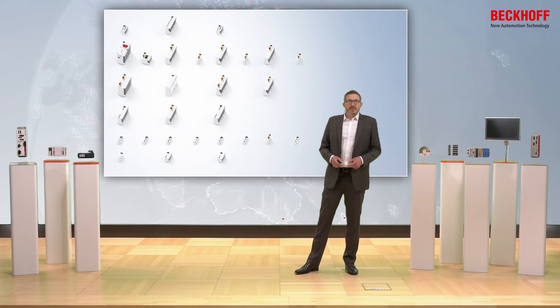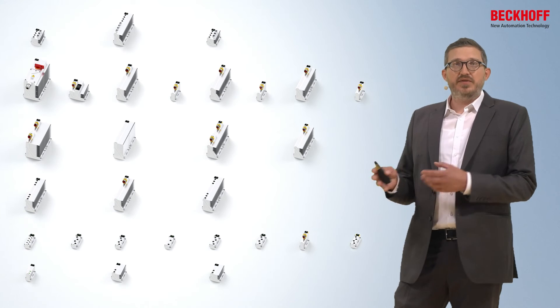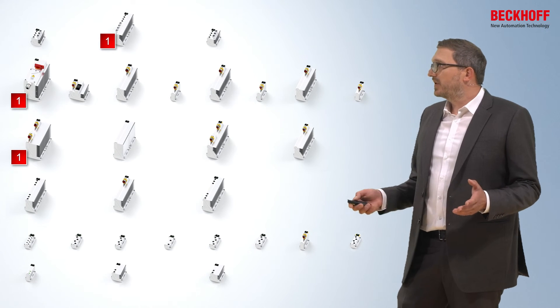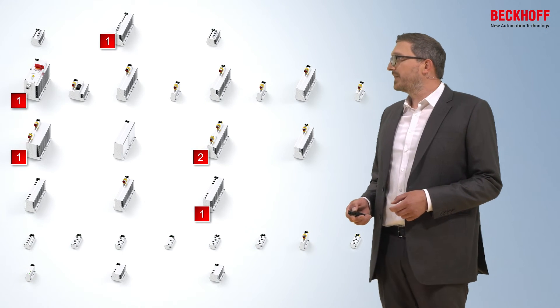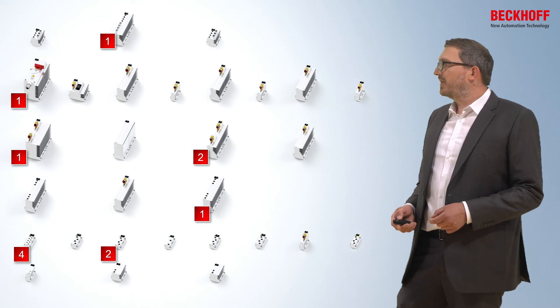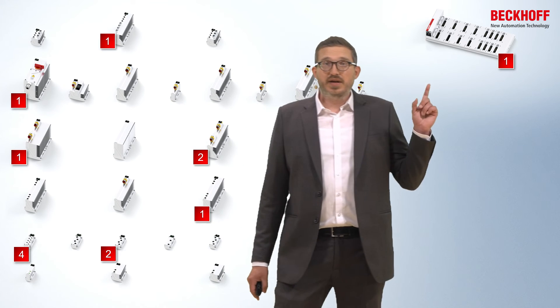The design of the control cabinet is essentially replaced with a simple shopping process. Once you have your application designed and know what you need to do, you choose the appropriate components: beginning with an IPC, the main power infeed, and because you want to control some motor drives, you take the DC link power supply, some servo controllers. If you have a heating tube control, you can use a relay module, plus all the IOM modules you need including safety modules. The last thing to complete your system is the base plate.